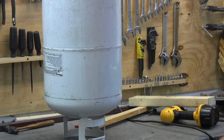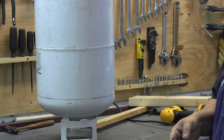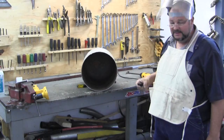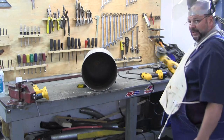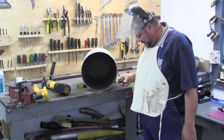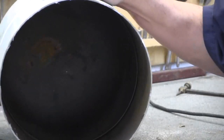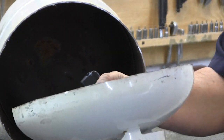I got that line marked. I just stood the tank up in there and drove the jig around it. I'm going to get my cutter out and go to cutting. That's a nice smooth cut and I'm really glad I used that cutoff wheel — I don't think my jigsaw would have made this perfectly. It's going to be really easy to weld.